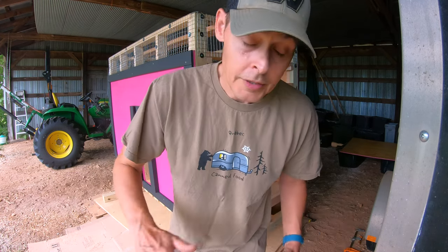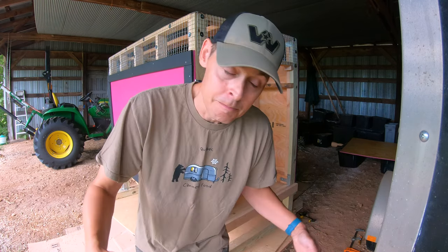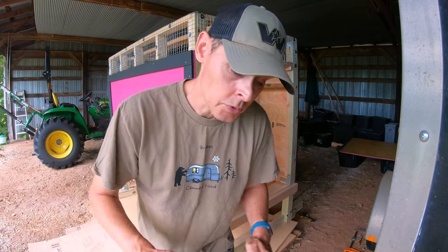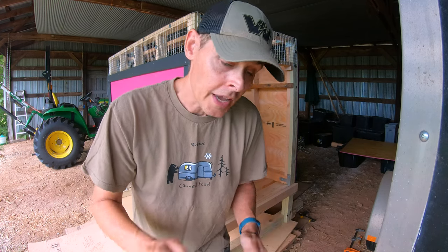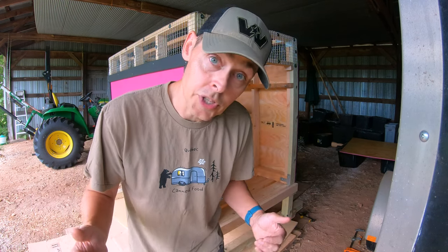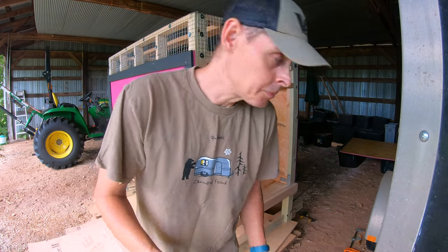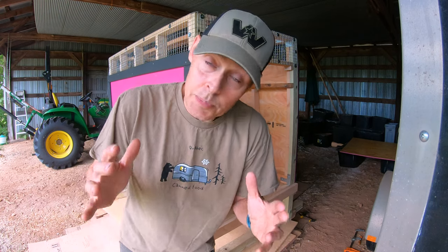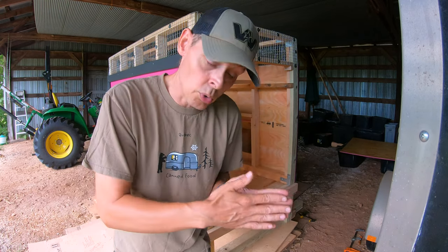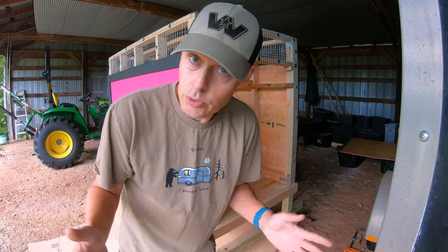All I'm doing is flipping the doors around so the paint is on the inside. All I had to do to make that happen was file off the drip edge that spilled over onto the wood side and then touch it up with a little bit of spar varnish. Hanging big doors by yourself is tricky, but really all I have to do is position two bolts so the door is held in place where it's supposed to be, and then the rest of the bolts should be easy.